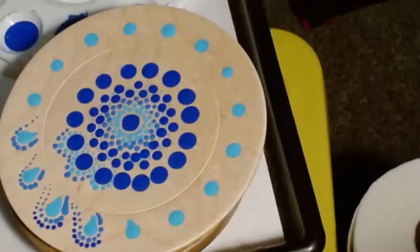Hey, Matt, would you put anything on top of that now to seal it? Yeah. After it's dry, I will go through my process. I'll put at least 3 or 4 coats of lightly sprayed lacquer on it. That's what's on top of the box top here, 4 coats of lacquer, 5 coats of lacquer, something like that. I just kept spraying it till I was happy. And they're light coats. If you put a heavy coat on something, you might start dissolving the paint and things will run. You don't ever want to put heavy coats on something you've painted.